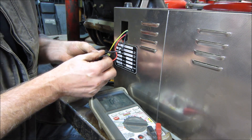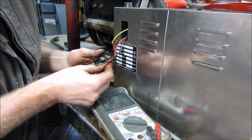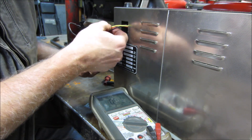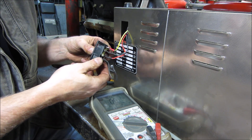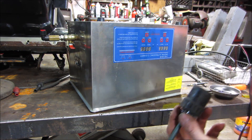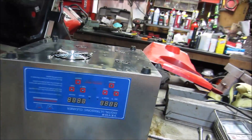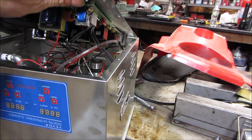So we want to take where the power comes in and wire it direct. We'll still have the fused circuit, we just won't have the switch. Put that back on and to the ground — the other half of it. Let's plug that back on again and make sure the screen turns on. We got it. All I'm going to do is button it back up. That switch is probably just not rated for the current going through it. We still have a fused link, and we do have an on/off switch because of that plug-in timer I showed you.